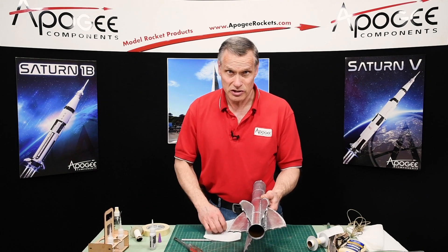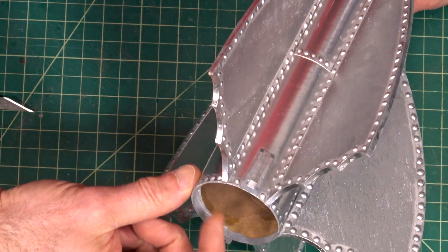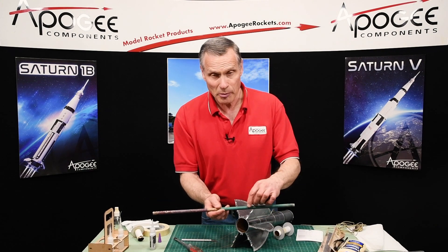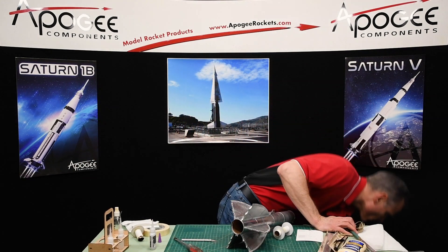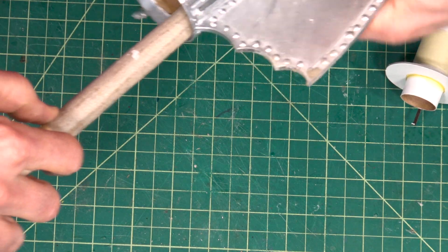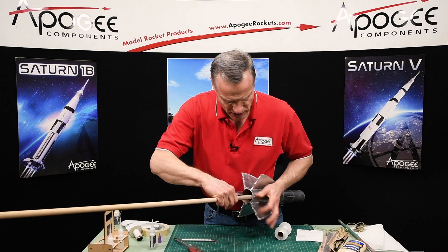The accelerator just accelerates the chemical reaction so that it hardens faster. Now I've got to get the rest of the flashing and fillet off the inside. For that I use wood dowels wrapped with sandpaper — I've got a large diameter one made really long so I can reach up inside long tubes. I'm just going to start sanding the inside of the tube until it's flush, to get rid of that fillet on the inside.